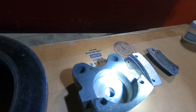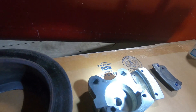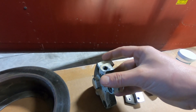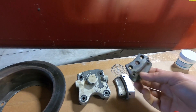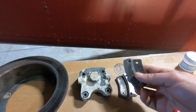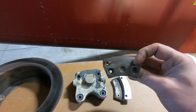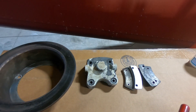Next to it I have a Cleveland wheel cylinder removed from a Cessna 172 — very typical of the sort of problems that occur. It has deep pitting in the wall of the magnesium housing. What was happening was the piston was starting to leak and weep hydraulic fluid, and you couldn't get a seal because of that corrosion. The fluid quality in this brake was very poor — definite neglect. Furthermore, this unit actually had a crack in the housing near the top, where the AN fitting that brings hydraulic fluid from the master cylinder was attached, so the entire housing needed replacing. I also have a backing plate that holds one of the brake pads — the holes on this have been badly damaged, probably by using a drill instead of the correct riveting tools. The result is you can't get a good seal on the rivets when you squeeze them, and you get movement in the brake pad itself, which is not acceptable.